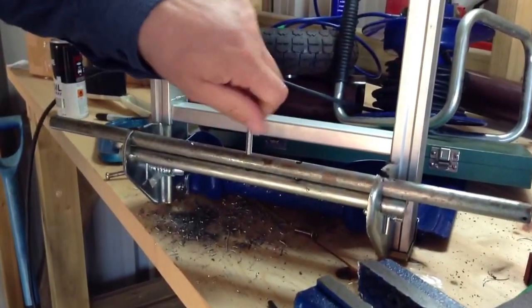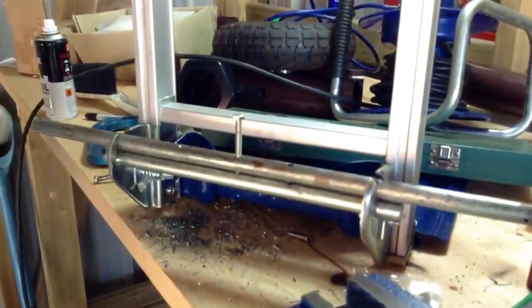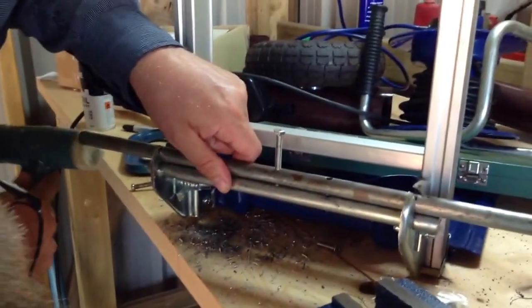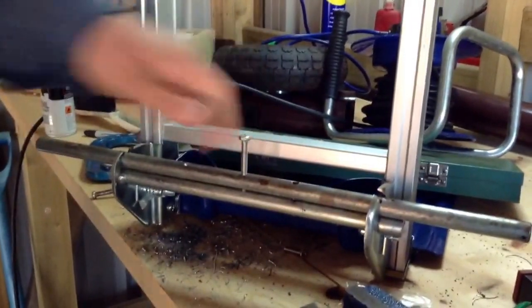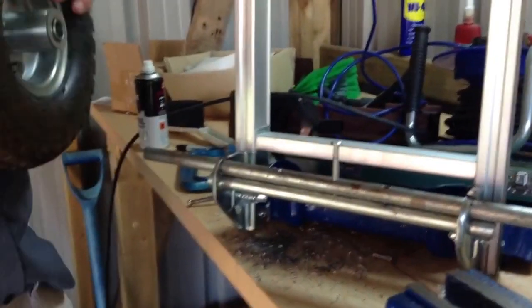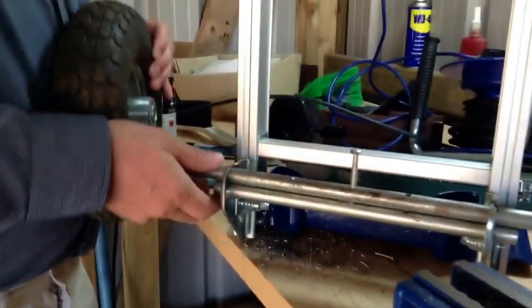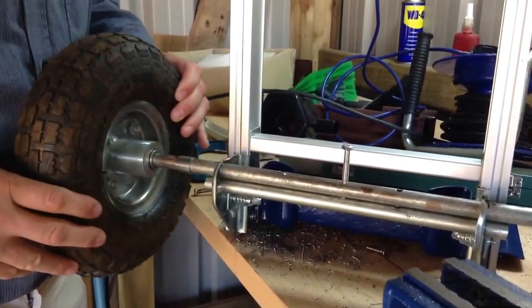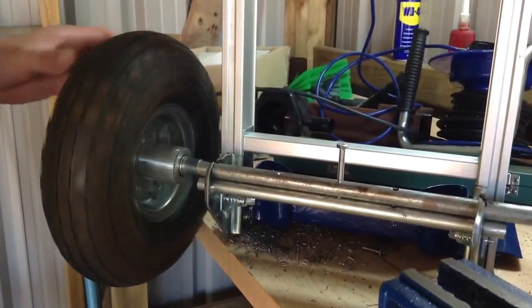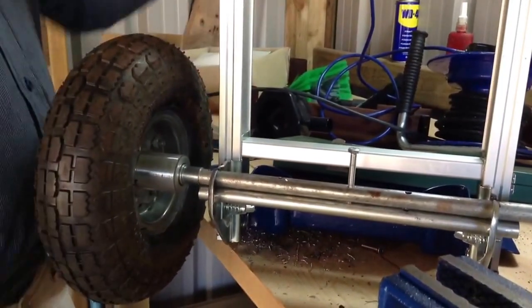It's got to be as strong as a weld because once we get the backpack on it's going to be really heavy. That should screw straight down and basically bolt on like this — this is just for demonstration purposes. Instead of those solid tyres that we previously looked at — see this? — what we'll need to do is put a spacer on, which we'll work out once I've got the bolt in that position. We'll put a new split pin on and we're going to have pneumatic tyres on a £30 sack barrow.